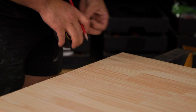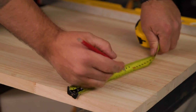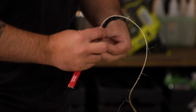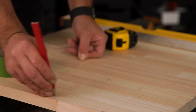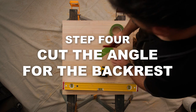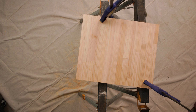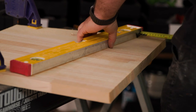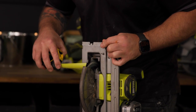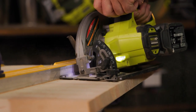For a sleek design, create a curved look for the top of the side arms. Grab a piece of string and work out your desired radius — we've gone for a wider curve. Mark your desired curve on one side of the panel with a pencil. To create a reclined look, you'll need to cut an angle on the chair sides where the base, back and arm panels meet. Mark out a 10 degree angle from the top left of the panel to the bottom.